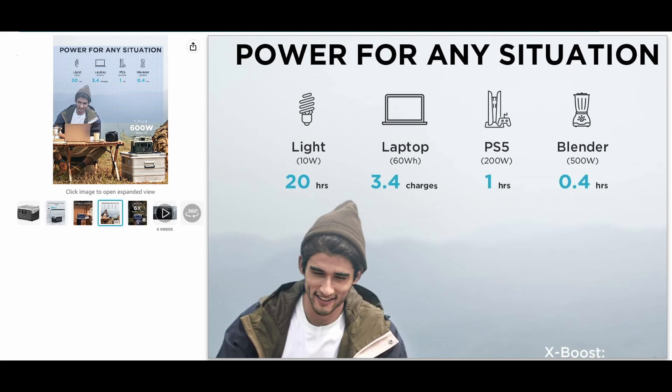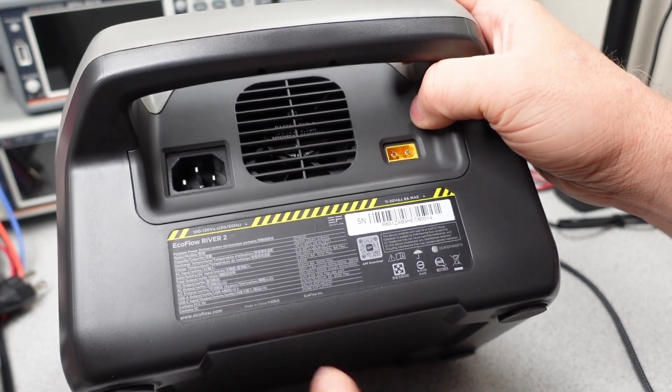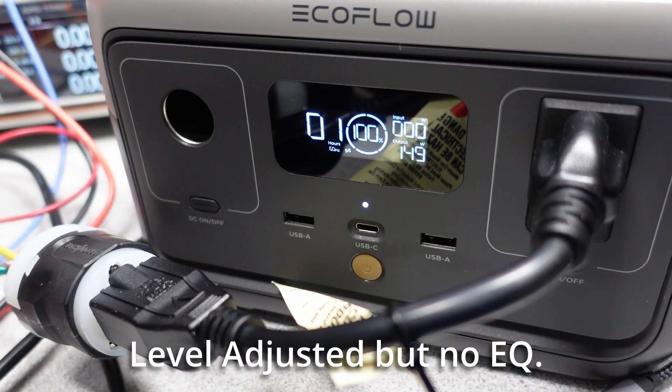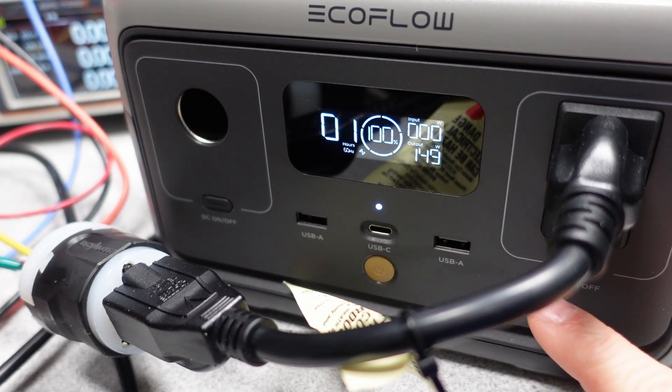Except the blender — what? This power bank can run for about 3 hours and 37 minutes with a 60 watt load on the USB port. On the AC side, I got 1 hour and 20 minutes runtime with a 150 watt load. This is good, and the unit never gets so hot on the outside or shuts down during any normal use conditions. The unit does have a fan in it — here's a little clip of the sound that the fan makes. It is quite audible, but it does mean that the unit doesn't get too hot under any conditions.